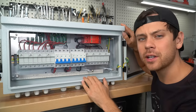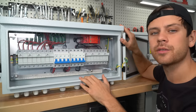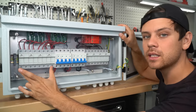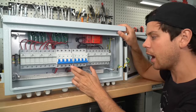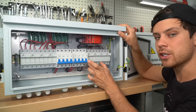Now let's talk about how to size a combiner box. Depending on your array will determine what size you need. On this combiner box we have eight DC positive inputs and eight DC negative inputs, and in the middle we have two DC outputs. So each output can handle four parallel strings each.